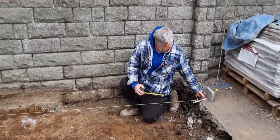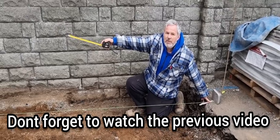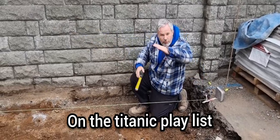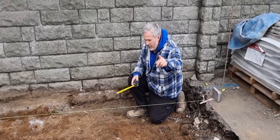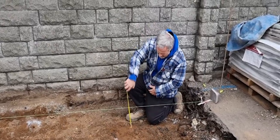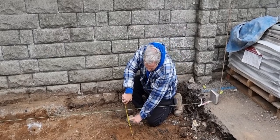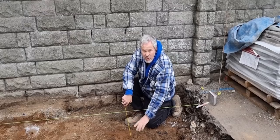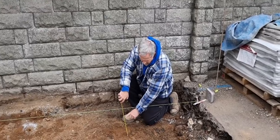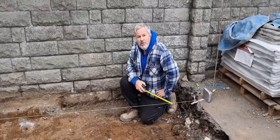We've got this string line set up now, so this is going to be our final destination up there on the existing park. That's the other part of where we're going to be going — all the falls are coming this way. We'll sort the drainage out, but what we're going to be doing now: there's 300mm there, we're going to be filling up to 200mm. We're going to do that in two stages — 100mm, whack it, another 100mm, whack it — and then the base will be done right the way through.